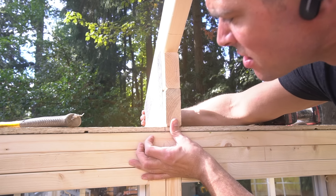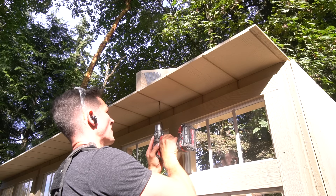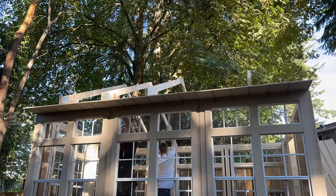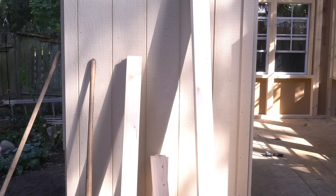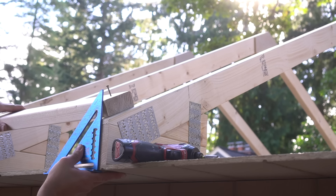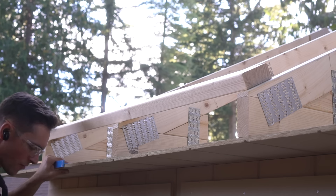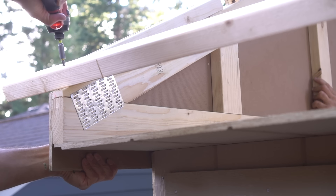Once fully assembled, lay it on top of our soffits and align it with the inside edge of the soffit. Once proper positioning is placed, I secure it with three 2-inch long screws on each side. These screws will keep our rafters stable, but it won't be very structural until we get further framing that connects all these roof rafters together. Each one of these roof rafters is placed every 24 inches, which is important because it comes into play with our framing. This framing is also pre-cut to the exact lengths needed, and there are multiple lengths associated with this structure. The first row needs to be in perfect alignment with the very end of our roof rafters. Our kit comes with triangular wall panels that connect into this framework, which is extremely easy to account for because there are notches already built in so you know exactly where your framing needs to go.